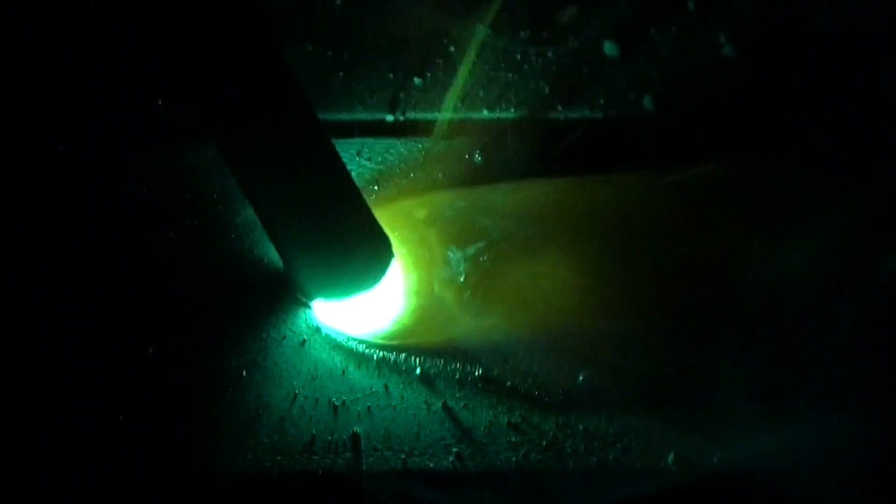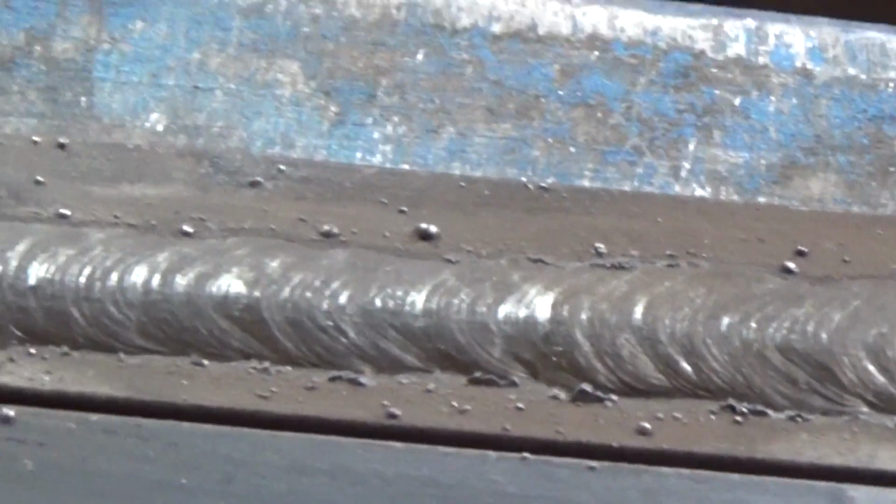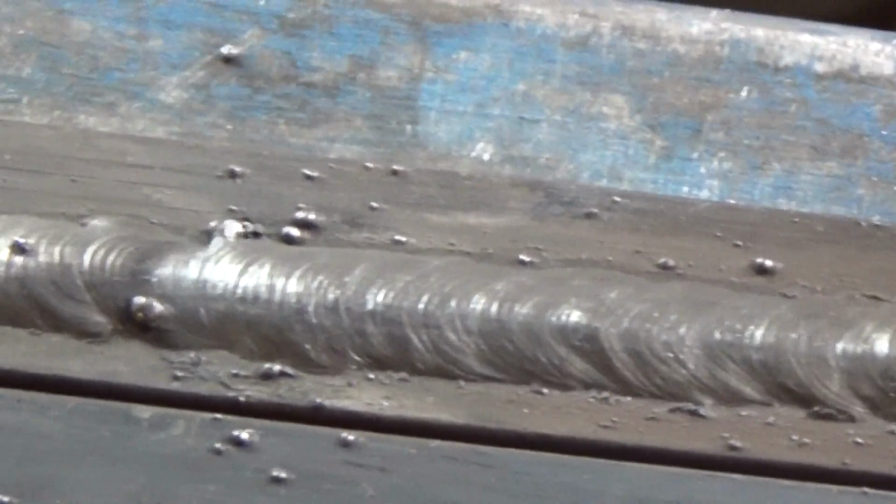And finally, the third weld: rutile coated electrode negative, current is 95 amperes. Look at the fact that the puddle is very fluid. It's difficult to manage. Metal excessively spreads over the surface. Quite a lot of large and small sputters are produced around the weld. Welding at this current is very fast. The arc is very bright.